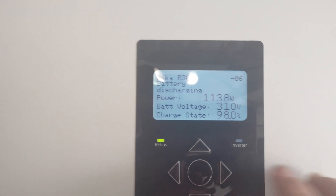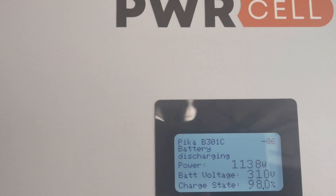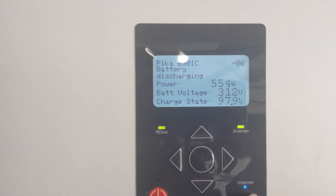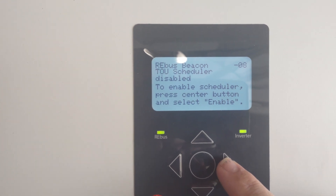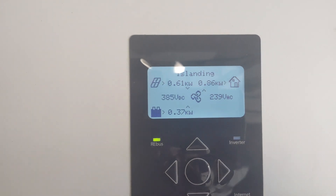The battery right now is enabled automatically when we do a black start — or dark start. We're watching it flash right now saying it's discharging. Coming back over here, it's telling us it's discharging right now. Our internet light came back up because now it's powering the house. We're going to go over here and hit the Rebus beacon — we don't need to worry about that because this doesn't have time-of-use rates. And we're back here and it says 'islanding' — so we've actually got the system all back up and running.